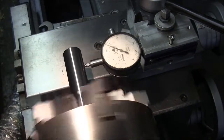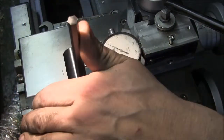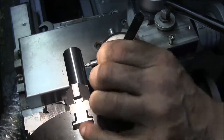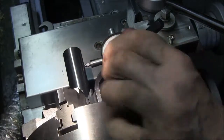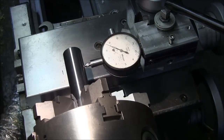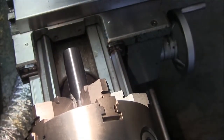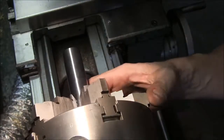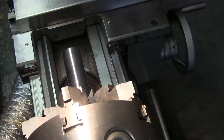It's running out 1/10,000. That's within the tolerances of my bearing specs. So we'll put the final pop on this. Get in there. I'm not going to complain about that at all. So that's how you service and adjust a Bison Set Tru 6-jaw chuck made in Poland. Thanks for watching.